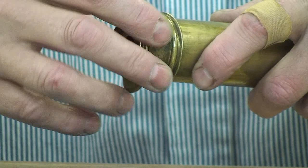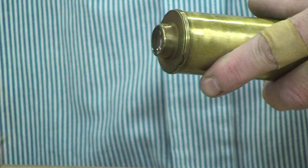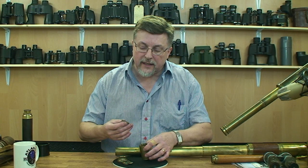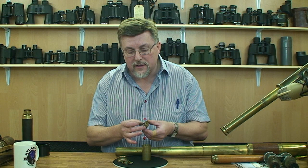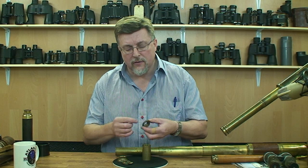This has been very nicely done. Let's have a look at the eyepiece end on this very characteristic marine telescope. I'm just going to unscrew the barreling here. This has got a multi-part construction — you can see there's actually about five parts making up just that end piece. Taking the cap off, we've actually got a nested tube here. I always like the way they've done a little cutout here so you can just get your fingernail in and draw this nested tube out.